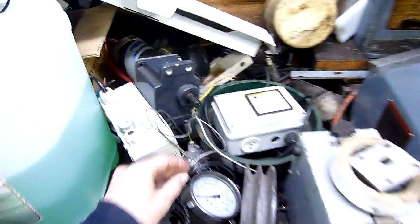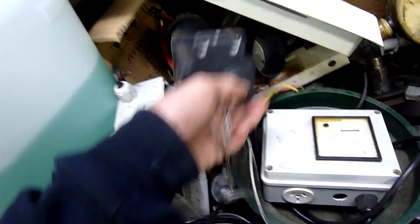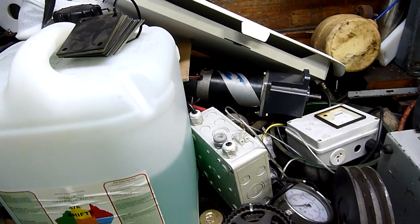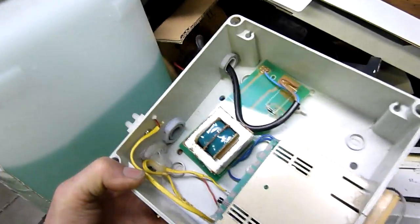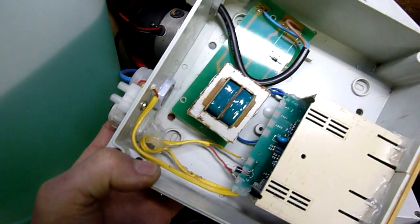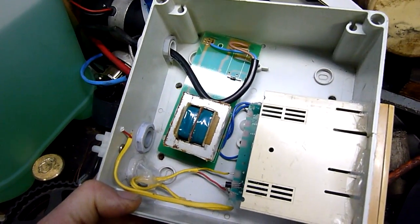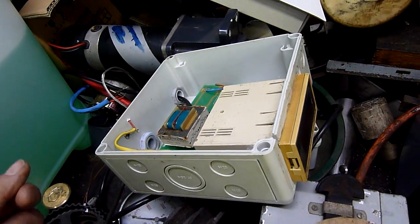As soon as I fix my current thermocouple — it sort of works. It was working for a while, and now the readings fluctuate by many degrees constantly. It's just flickering and carrying on, so I'm going to check the power input again. This is one that I built using a power supply from an old swimming pool controller, and it's going absolutely crazy now. It was working fine when I put it together, but I'm thinking I need some more power filtration going in. I'll tear it down and see what's happening.